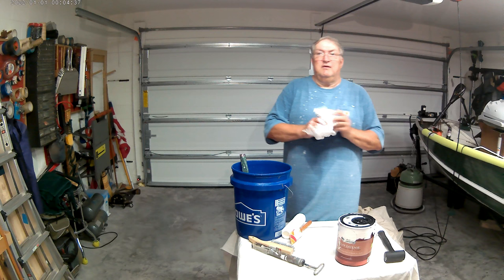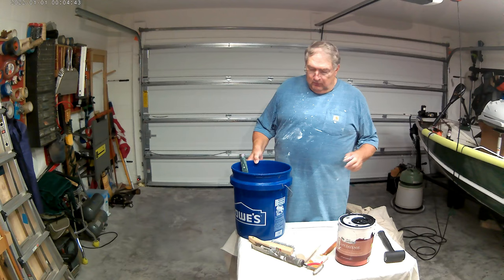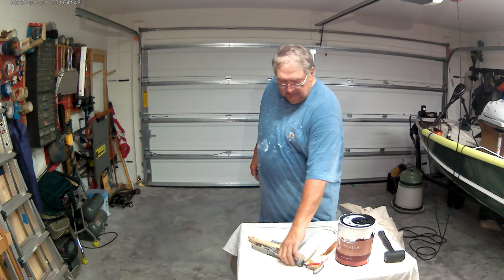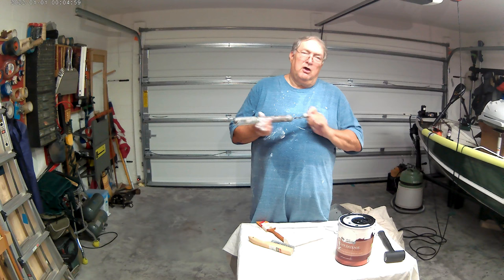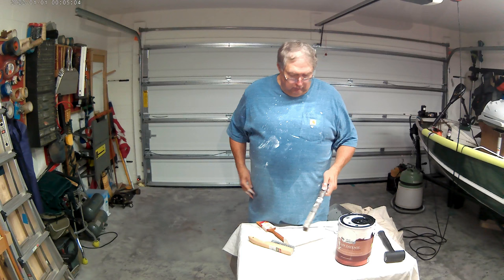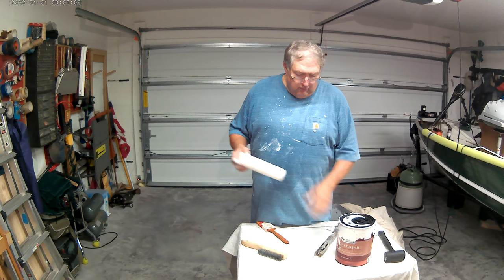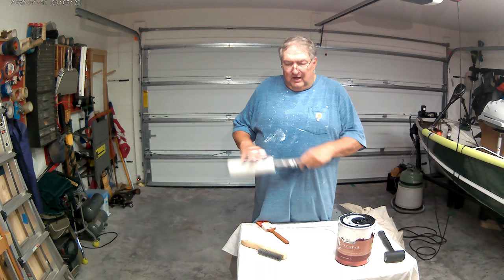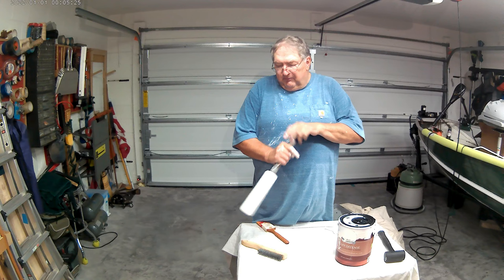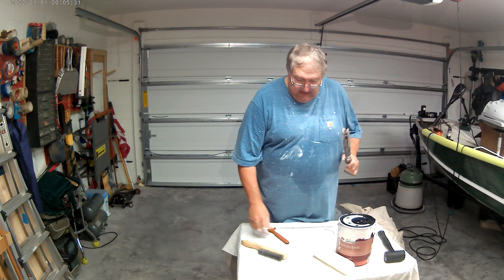Now I don't want to use dirty water to show you how to clean your brush and roller, so I've got a clean one here. I have this device — my father-in-law always called it a spinner; I suppose it's a roller cleaning tool. What you do is take a bucket of water, soak up your roller real good, shove this into the end of your roller, and then you can spin it and spin that water right out. Use soapy water, dunk it again, or use the garden hose — do that about half a dozen times, spinning it down into your five-gallon bucket, and you can clean your roller and use it again.